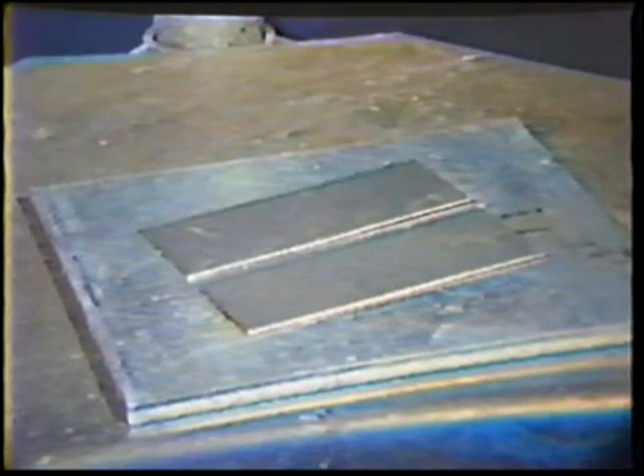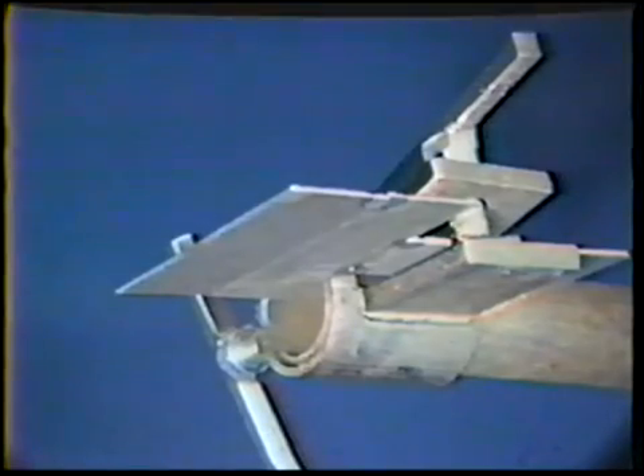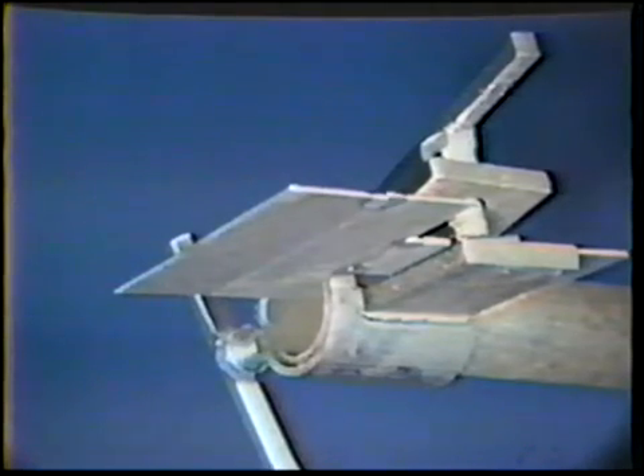The workpiece for this part of the job practice is a square groove butt joint tack welded at one end. The root opening should be 1/32 inch wide. When the workpiece has been tack welded without filler metal, you may want to tack weld a small plate to one side to aid in clamping to the fixture. This weld will be deposited in the overhead position on the underside of a horizontal surface; the tack welded end should be nearest to you.